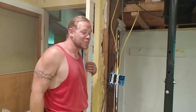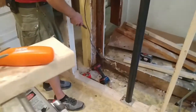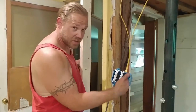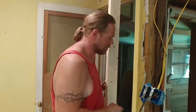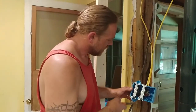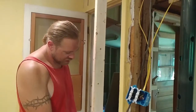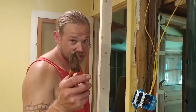It's getting really hot right now — I'm a little drippy. We got our beam out. In order to put in our bottom plate we had to move this wire, which means we had to pull it out of the box, and this thing was a jumbled mess. It's got these connectors — let me tell you, these connectors are awesome, but not for this. This isn't part of the package and there's still an electrician coming who's going to rewire everything, so I'm going to leave them for now. They're safe but not ideal in a situation like this — it's a quick connect in a ceiling box. Just use a wire nut at home. We fixed it; unfortunately the disco's gone. We're here for the beam work, so we're going to focus on that — but I'm here and I've got to move the stuff, so may as well fix it. Do the right thing, fellas. It'll reward you.